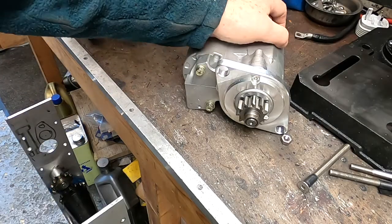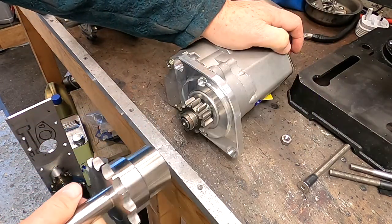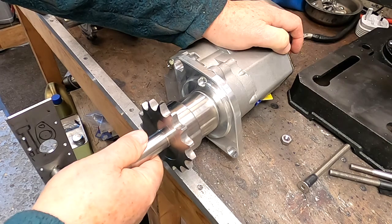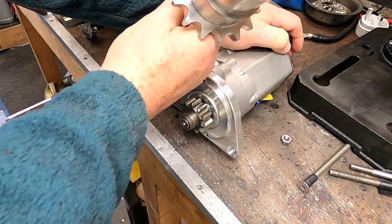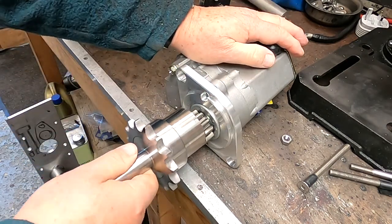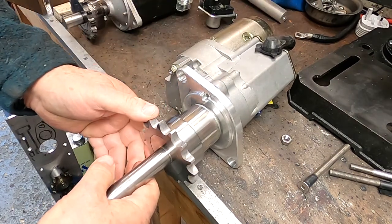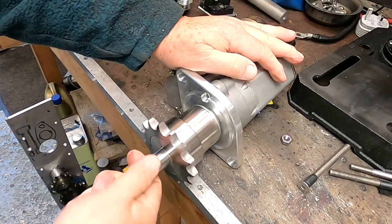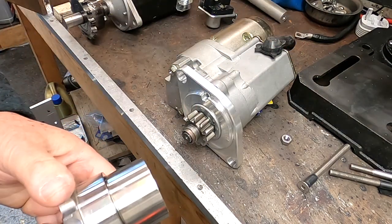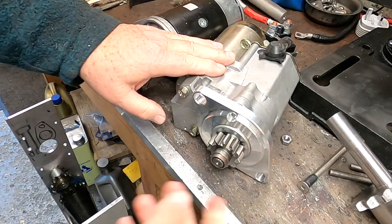This gives you a view of what all this has been about. There's the serrated edge and there's the gear, and that will sit there. There's enough depth in here to allow this gear to slide out and engage and stay engaged, so this will work nicely, and of course it'll pick up on the chain. In effect, this has taken me a while to get here but this is going to work. I said that once before, but I think it did work — it's just this old motor wasn't really powerful enough. This thing I have high hopes for anyway.